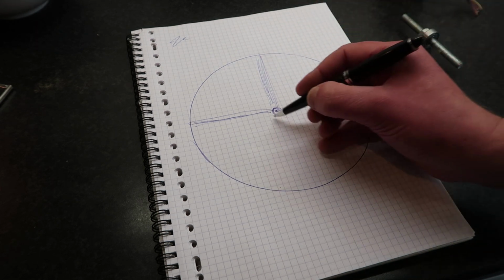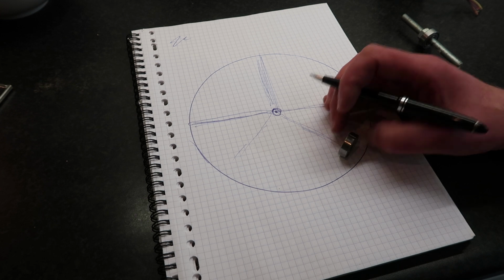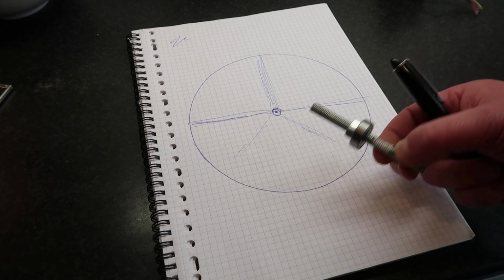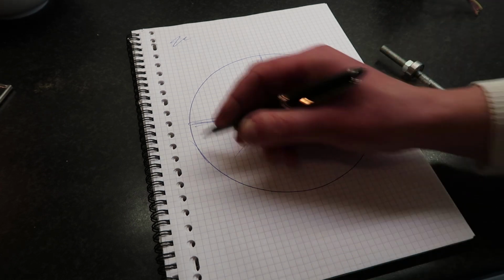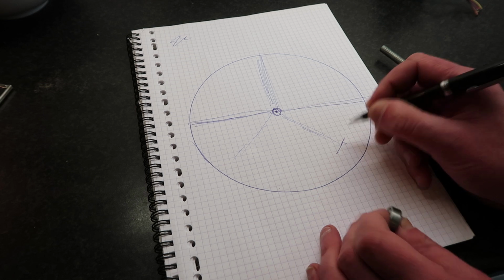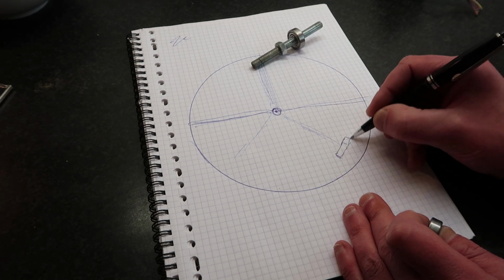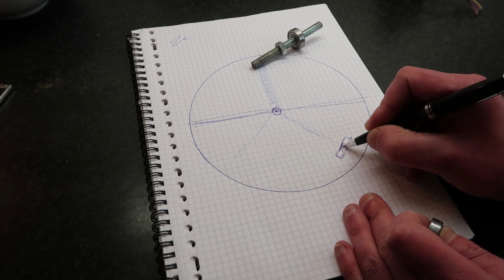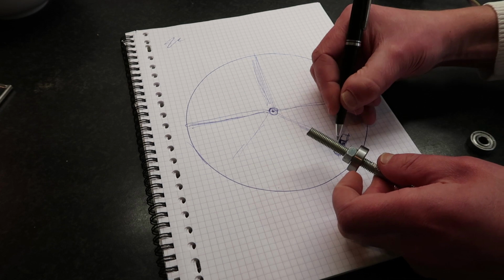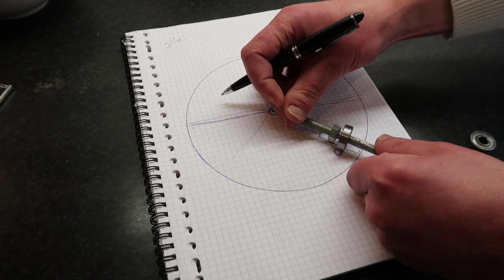So, let me see. This is 1, then something like this. And then the bearing is gonna sit like this, but on a piece of 8mm threaded bar. Much smaller than this, but... So, I'll first make a plate where a bearing sits here. So I cut out a groove the size of the width of this rod, which is 8mm. Slightly under, so I can press fit it. And then there's gonna be a bearing here, riding. So this is a top view. Oh, this is incorrect. So I made a groove here that is like 7.8mm or something, I don't know. So I press this in.